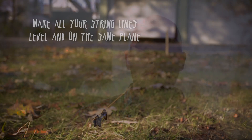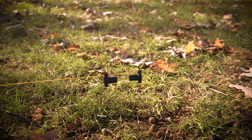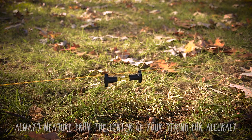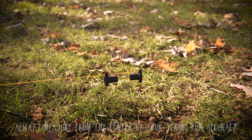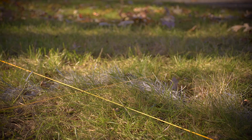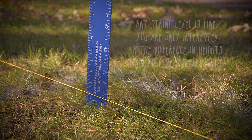Now is the perfect time to measure our elevations. Our lot is relatively level with good drainage — I'm just going to check elevation so there won't be any surprises. Take your string lines and make them all level; you're going to want them all at the same elevation too. We are going to make measurements along the way, and the grade will be the difference in our measurements.